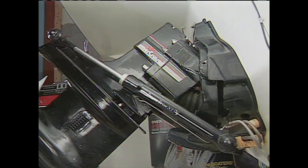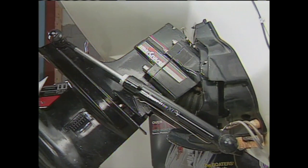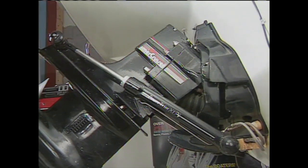The first line of defense for your outdrive are the sacrificial anodes. An anode is an unpainted and exposed piece of metal that is designed to wear away slowly from the effects of corrosion or electrical fields within the water.